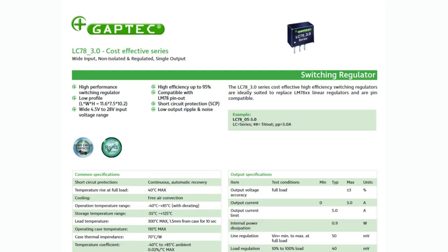These are available in 5-volt and 3-volt versions, and there's a whole family of these, but these are the new ones that are up to 3 amps output. Three amps is actually where I'd say it's better to get something pre-made than to DIY it — once you get to 3 amps, layout is really important. You might need 2-ounce copper instead of 1-ounce copper, or 4-layer PCBs. If your design needs high current but isn't overly complicated, something like this is really easy to use.